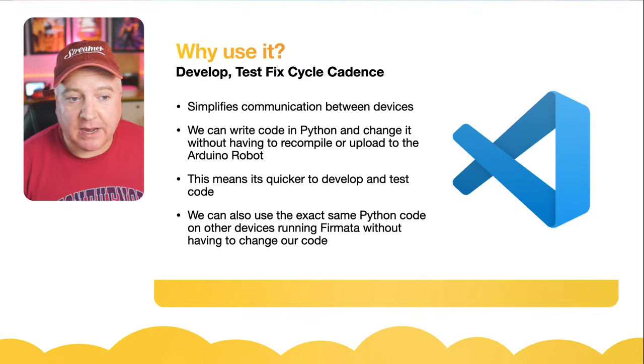You can just see his head just hiding here. So that's my InMoov robot. And instead of using this thing to control all the different servos, I was going to use this board instead, which is the PCA9685 board. You can plug all the servos into that, and then you've just got essentially two pins coming out. A lot easier to control, and it's just a different way, I guess.